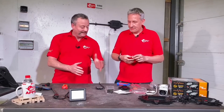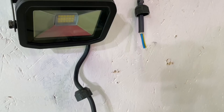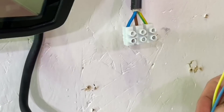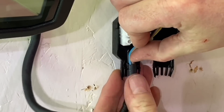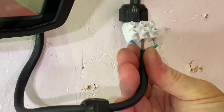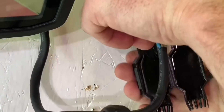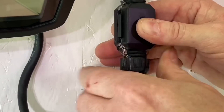We've got a shortened version of making the connections, and we'll talk you through those as we go. The Fred itself needs the splits on top and bottom — we've got to split the plastic on both sides. The cable comes into the box with a 25mm conductor length and 6mm of insulation removed, and we connect those up. You'll notice we're making the connections outside the enclosure — all your prep before you even introduce it to the box. Key that we've got our gland nuts on as well on the flex for the light fitting. I've ferrulled my ends — no forgetting that — then we connect those up, introduce the Fred, squeeze it into position and click it, then lock off the nuts both top and bottom. Then it's nicely IP rated.